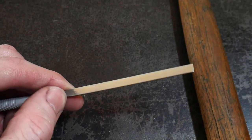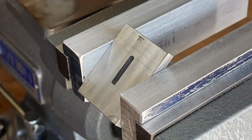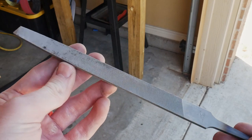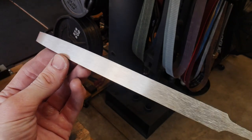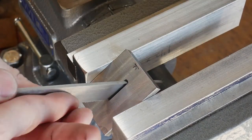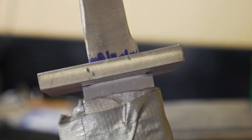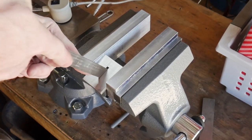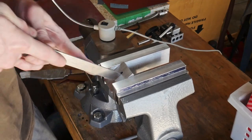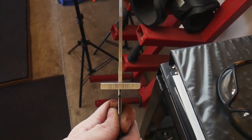This is how it looks when it first goes onto the knife. I then take some files that have been ground flat on one side so they are safe and do not remove material where you don't want. I file out the radius sections on the top and bottom of the guard so they are square and fit the tang. I went back and forth about four to six times before I had a fit I felt was acceptable. The guard fitting on a hidden tang knife seems to be the most difficult part of the build, and I still have a ton to learn, but I was happy with how this fit turned out.